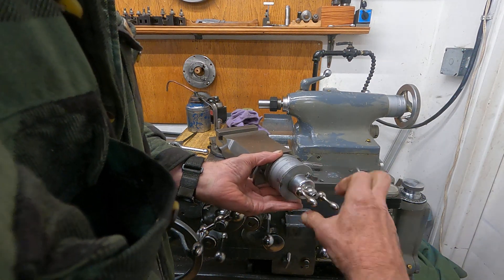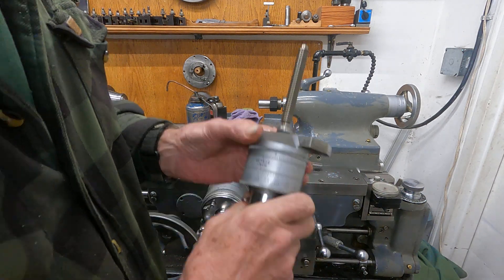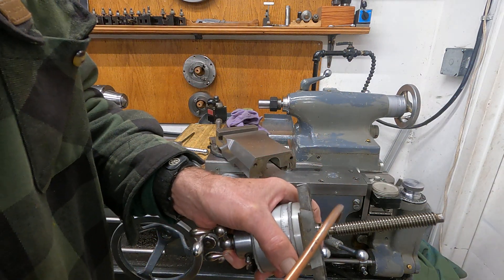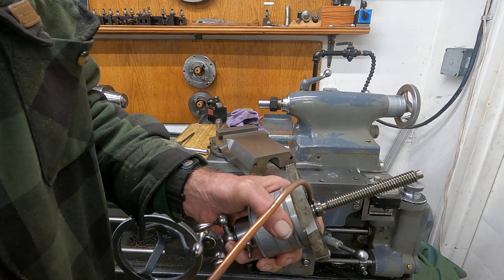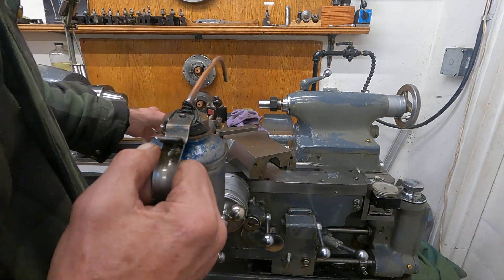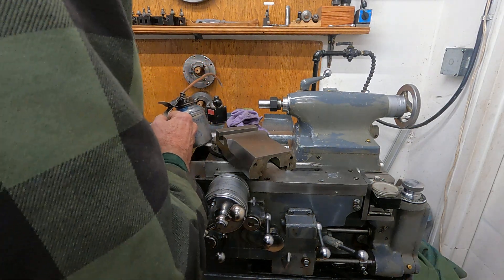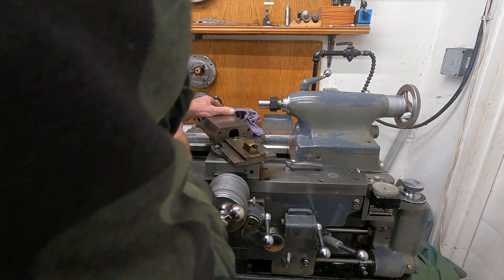You don't have so far to unscrew the screw. To service it, there's a thrust bearing right here — oil it. I use number two oil. Oil that and put oil on the screw — plenty of oil. You have to do this quite often. Now you can push this forward, but don't push it all the way off because then you have to stab the gib back in.